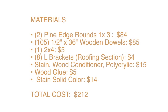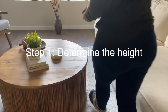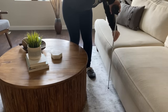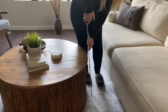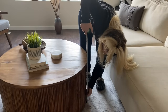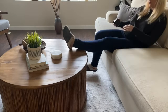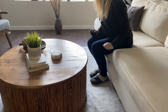It takes seven steps. The first thing you need to do is determine the height of your coffee table — everything is going to be based off of this. Generally speaking, you don't want your coffee table to be higher than your couch cushions. For me, this was a total of 17 and a half inches for my couch cushion, and I ended up making my coffee table just shy of 17 inches. Kick your feet up, pretend like you're building it and see if that height feels right for you.